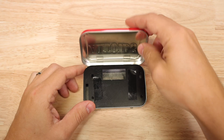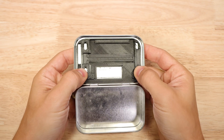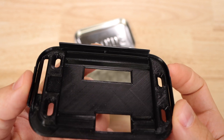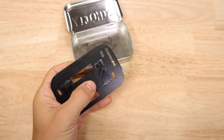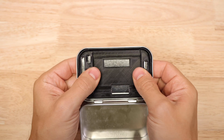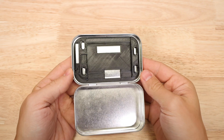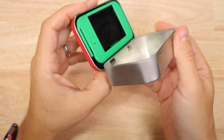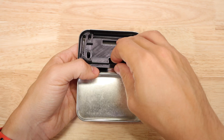In previous versions I recommended taking the screen back plate, putting it in the bottom part of the tin with some tape, closing the lid, and that would more or less position it in the middle — which was good enough for version 3.0, but doesn't quite cut it for this one. So here's what I came up with: if you look at the screen back plate, there's a brim around the top that is just barely connected to the rest of the part. Apply some VHB tape and press that brim against the top lip of the lid to press everything into place. Then grab the raised part of the brim and pop it right off — after that it should be lined up just right. You should still test it by putting in the bezel and slowly opening and closing it to make sure it doesn't catch. If it does, carefully pull the back plate out and use the brim to line it up again. I've tested this a bunch of times and 9 times out of 10 it puts it in just the right position.